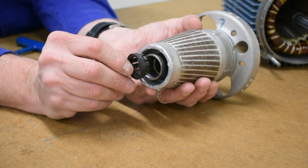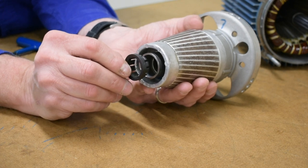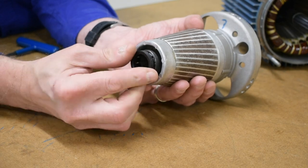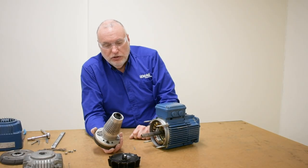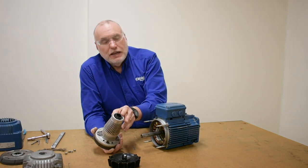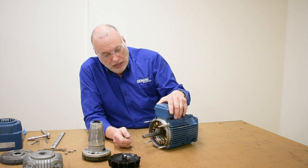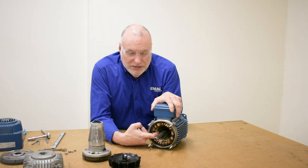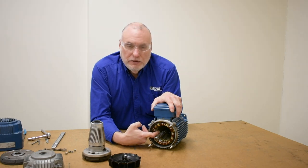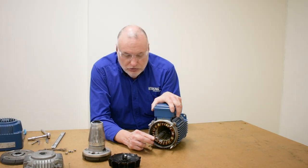This plastic thrust collar is the part that sets the internal rotor-stator air gap. They are plastic and exist in a potentially hot environment. You can find them melted or smashed over a long period of usage. They fit in the front with tabs — make sure to account for their condition. The thrust collar butts up against a collar on the main motor shaft.